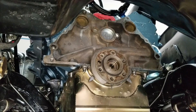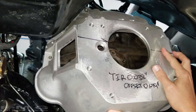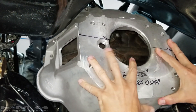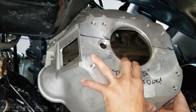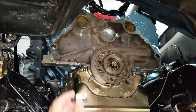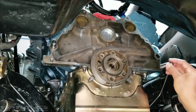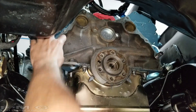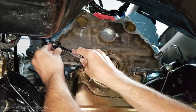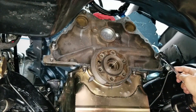What we need to do is figure out the orientation of our dowel pin. This is roughly where the bell housing is going - you can see the arrows here. This is where we need to point our dowel pins, so it looks like about five degrees down. I put some WD-40 on the ends to see if we can get these in. That one fit nice - we're good. Both of them need to be pointed in the same direction, oriented by the mark on the end.